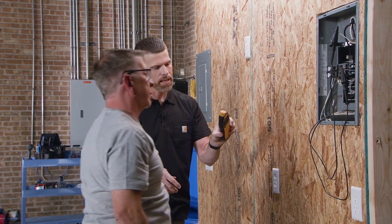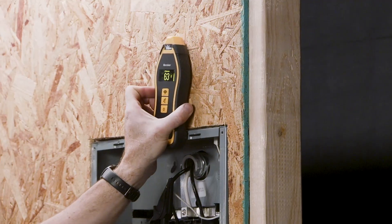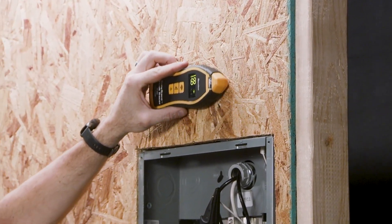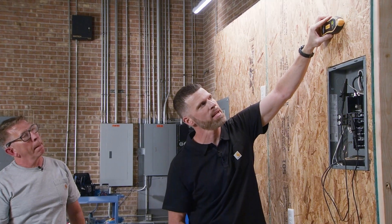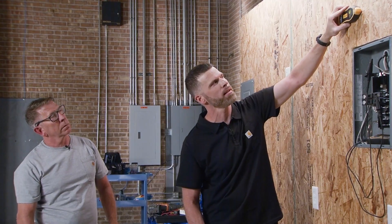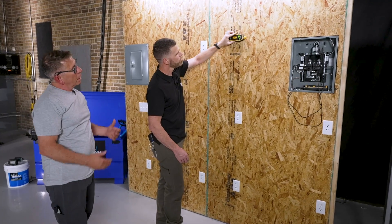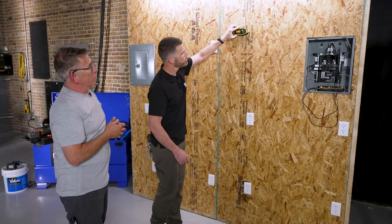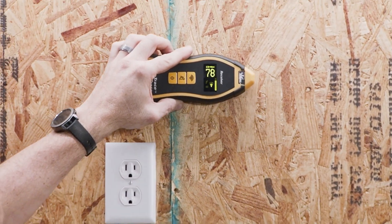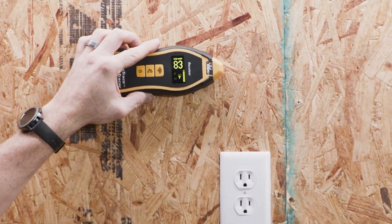The transmitter's on and they're communicating. I'll leave the panel and start scanning. I'm hitting a 91 as my highest number. As I scan up and down just looking for the highest number, as it drops I know I can start going the other direction again. In a kitchen environment where a wire controlling a circuit is broken, rather than rip everything off the wall and make a big mess, what we're doing is trying to pinpoint the actual spot where the wire is and cut just that spot out to keep the cost of the drywall repair down.